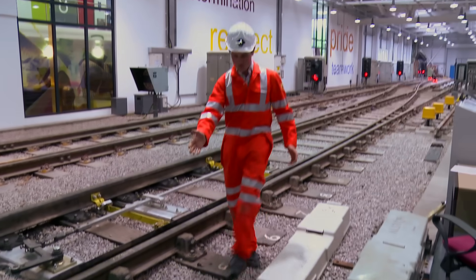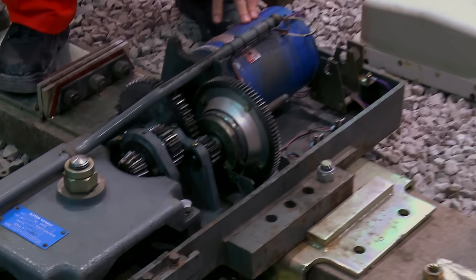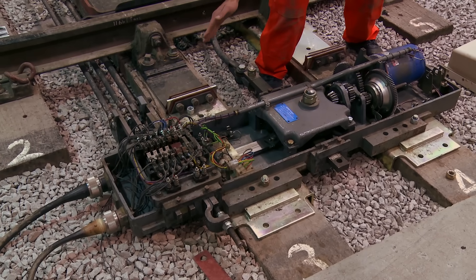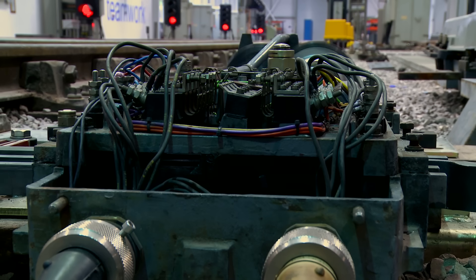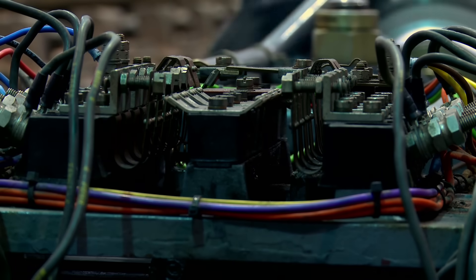This is an HW2000 points machine — it is electromechanical. What we have here is your drive motor. To check the motor has done its job, over here we have an interlocking and detection system. Detection tells us when the points have completed their travel and locked. Locking holds the points in this state so they cannot be physically moved, so when a train runs over the top, it remains in position. Facing point locks are one of the most important safety features on the S&C layout — they ensure that the points cannot be moved when set. This is important because failure to lock the switches could cause a derailment.